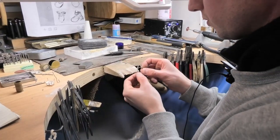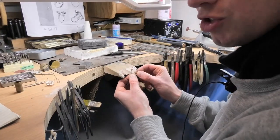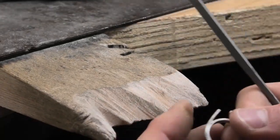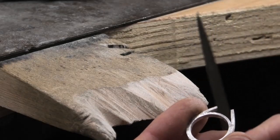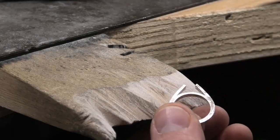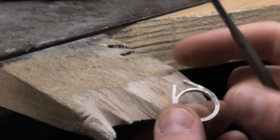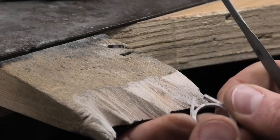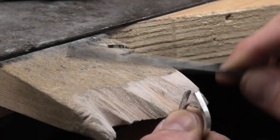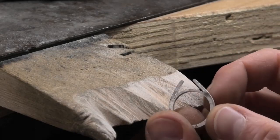What I decided to do is push it back up to a circle and join up the bottom part of the shoulders. So I soldered these back together, tapped it round, and now I can really be accurate — get them perfectly parallel all the way across both sides, nice and flat, nice and smooth, going into a perfect point at both ends. Both of these are at the same angle. I know I need to adjust them a little bit, but again: perfectly parallel, nice and straight, nice and sharp, flat on the top of the shank, flat underneath that split shoulder.